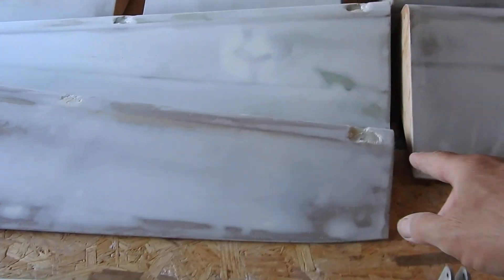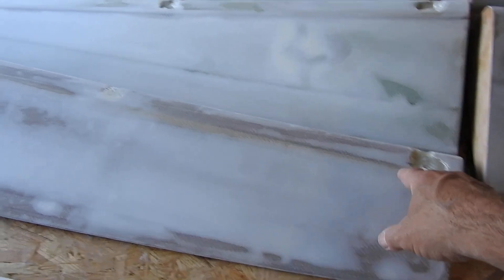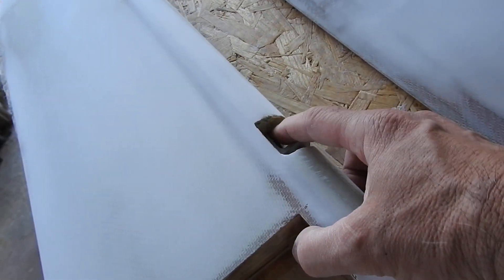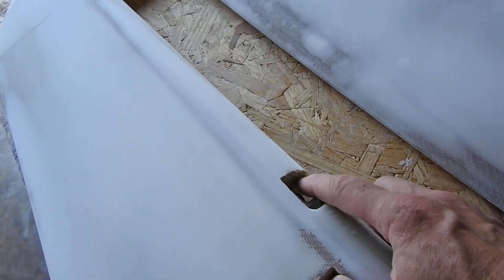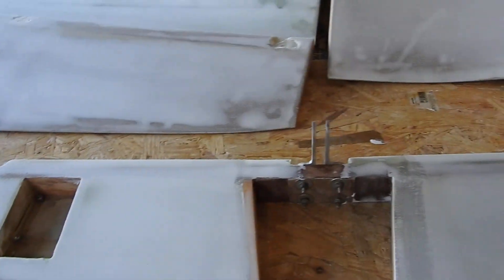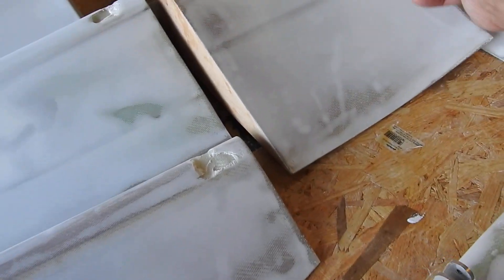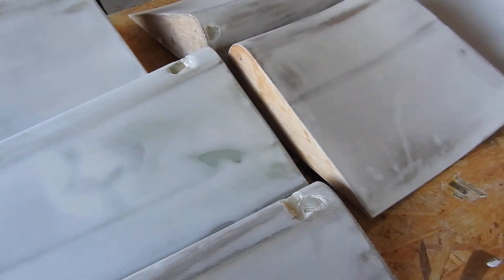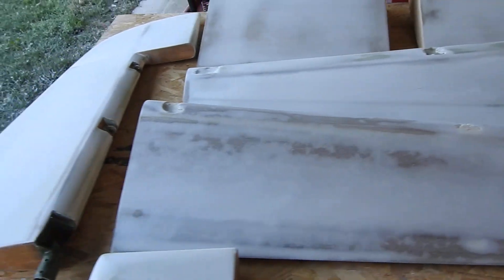During the week, I may go ahead and get these things worked on — get all these pockets cut out and shaped. As you can see, the insides of some of these are just styrofoam. That one's already got some epoxy in it, but I need to coat those with epoxy to stiffen them up. And as I put the epoxy wipe on, I'll be epoxying these plywood sides on too to seal that up. Then everything will be painted.